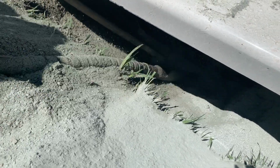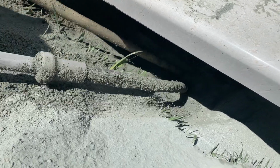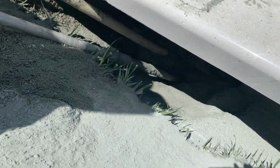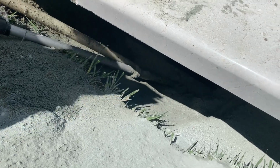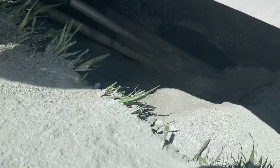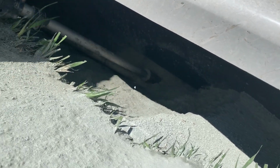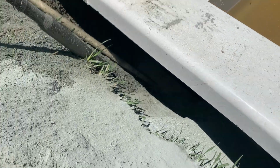So while we watch this in real time, the process from here is: fill the pool up 300 mm at a time. In this instance, it'll be up at 600 mm in depth. Push the backfill in and around the pool up to the water line, and then use your water rod all the way around the pool to wash the backfill in, making sure that it's getting thoroughly wet so it goes off and sets in place.